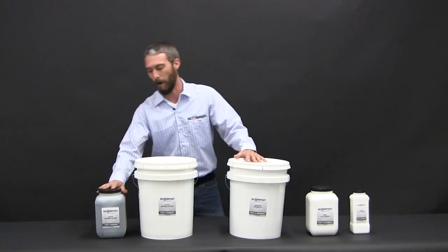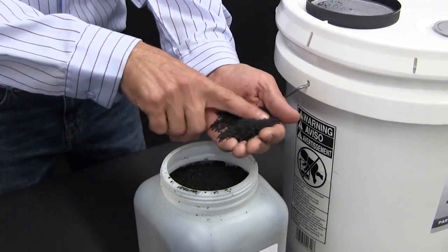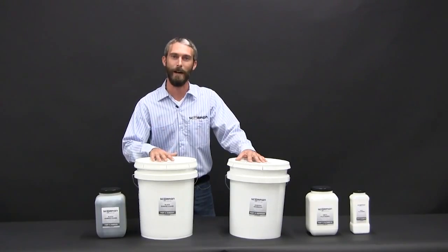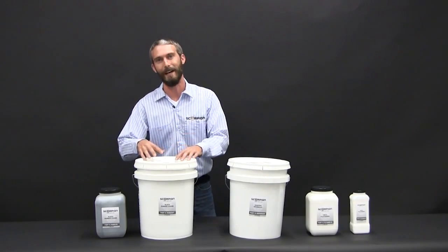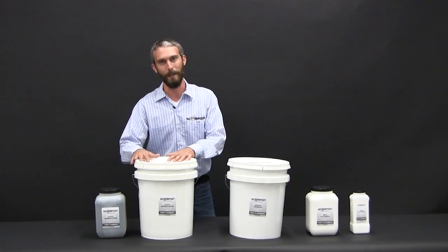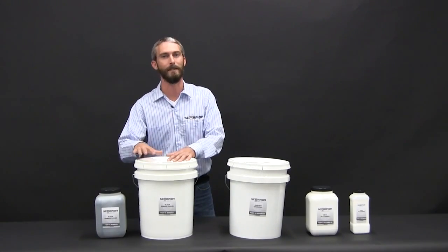The second is rubber crumb. This has become very popular for trailer floors, areas that you want non-slip, but you still have to be aware of bare feet, people down on their hands and knees, things of that type, because the gripper can be too aggressive. So what this does is you actually mix it in the entire batch. You get a nice rubberized coating with, again, additional non-slip, very popular for boat applications, boat docks, things of that type.